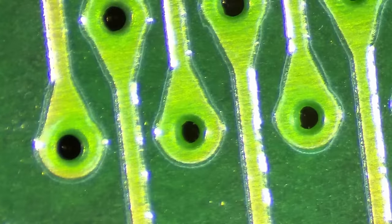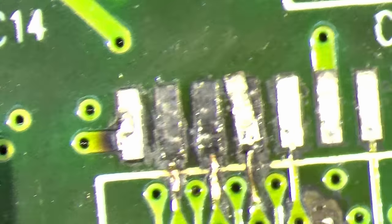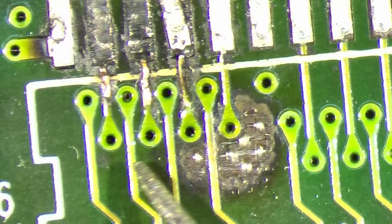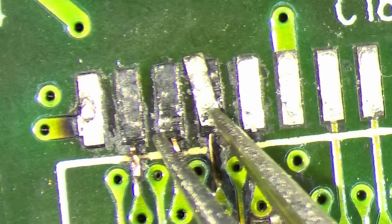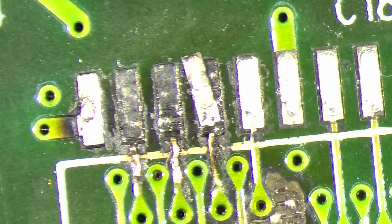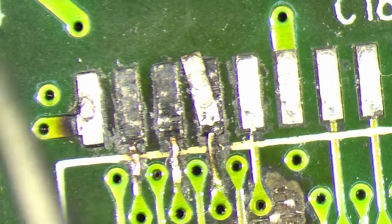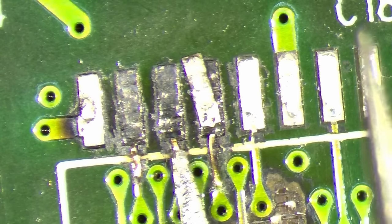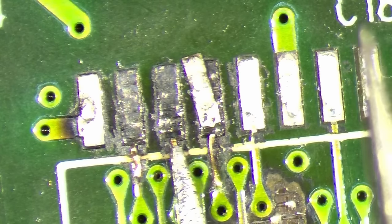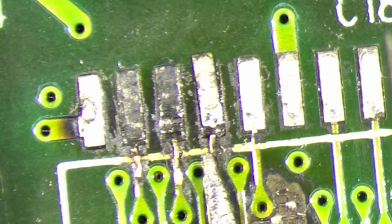If I'm not mistaken, this was the worst memory chip that exploded on this Voodoo card. So maybe there is hope after all. Only unfortunate part was that the pins on the memory chip somehow probably fused with the pads on the PCB, and that is why they were ripped off. Or maybe I was just not careful enough, but they didn't seem like they wanted to let go from the memory chip. Anyway, I have fixed some of those pads before, so this shouldn't be too big of an issue.